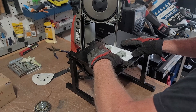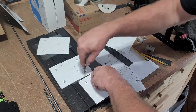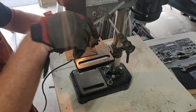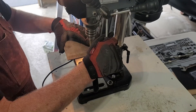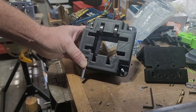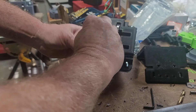I'm using magnets to hold the templates in place when cutting. Some people use spray adhesive to glue them down as well. With my plates cut out, I'm marking all my holes and drilling them out. Some parts that were on back order came in, so I was able to finish the gantry.